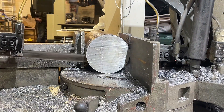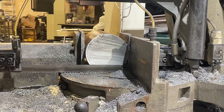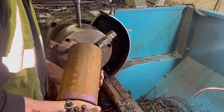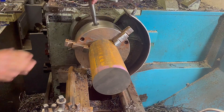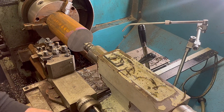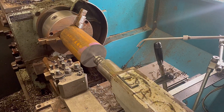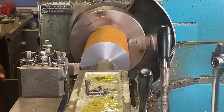The billets did come too long, but it's not an issue because we can use this material for future jobs. Now we need to clean this billet up - we're going to start by facing it up and then turning the overall diameter. You might notice we are only resting the center against the billet and not center drilling it beforehand. We do this because we can only have one centered hole in the bolts, and for the accuracy we're after, this does the job.